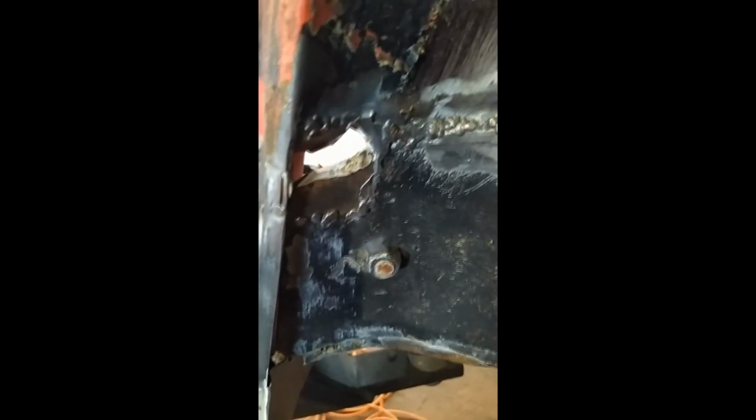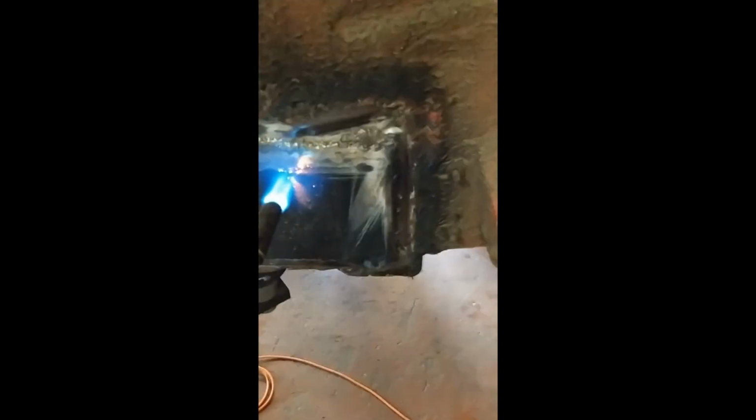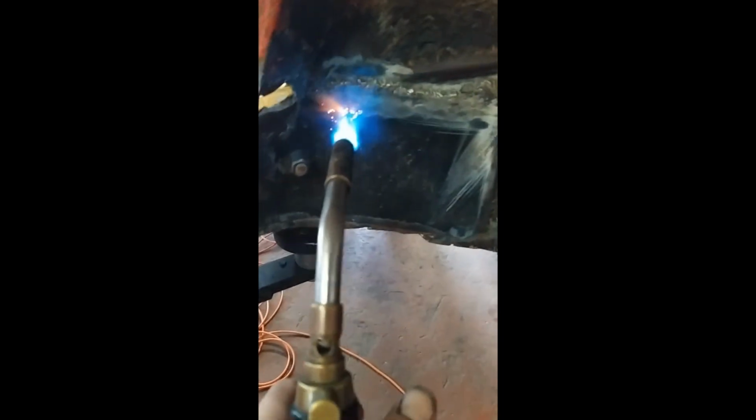There's a big hole there where someone covered the hole up with a bit of tin. And then, yeah, hasn't even been welded down there, all along the bottom. So I'm just going to be quickly putting some heat into this big thick plate so I can get a better weld into the plate while not blowing big holes into the really thin steel of the shell, and then hopefully they'll be a lot nicer than the ones that whoever did them.